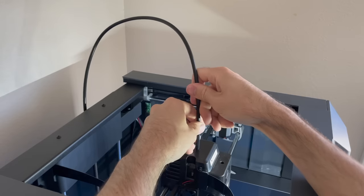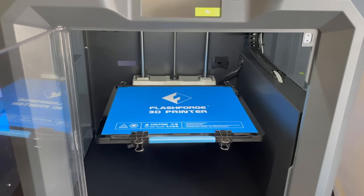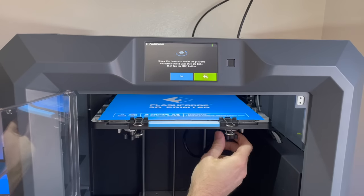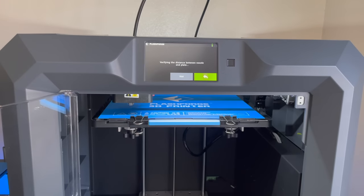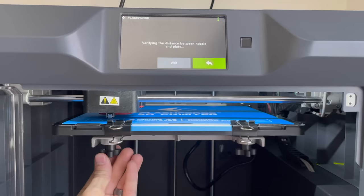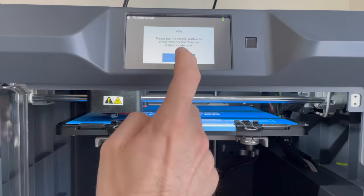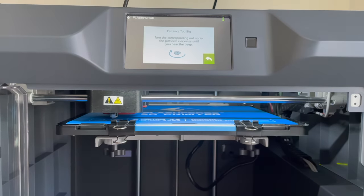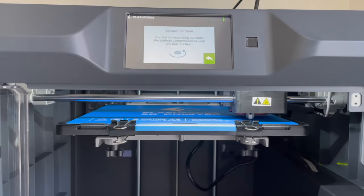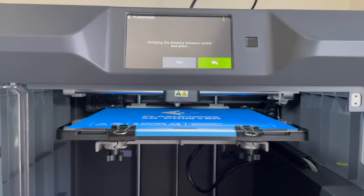This is not a Bowden tube printer — it's a direct drive printer. There's a guiding tube that guides filament from the back to the direct drive extruder. For bed leveling, it has an assisted leveling method — screw all the knobs down as tight as you can, follow the menu prompts, and it checks the bed is level. At the end of the day I still had to adjust slightly while printing, using a skirt like I do with all my parts, but once you get the bed set you don't really have to deal with it anymore.